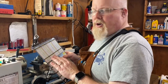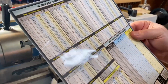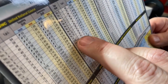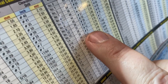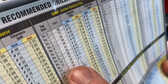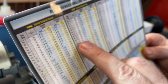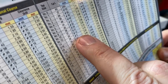One of the things I find very useful in my workshop — I think I got it on Amazon or maybe a local nuts and bolts shop — we're going to be doing a quarter by 28 tap. For that, we need a number three drill bit to make sure there's enough meat for the tap to thread into. You want to make sure there's enough meat, but not too much, or you're going to end up snapping off your tap. So for a quarter by 28, we need a number three drill bit.